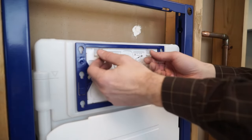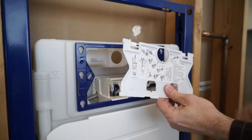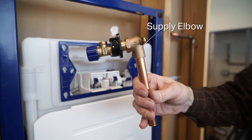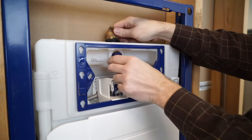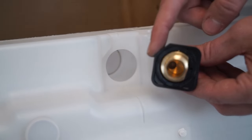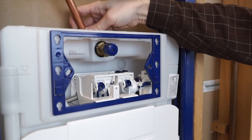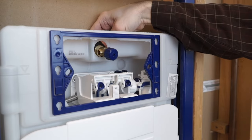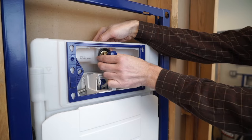To begin the water supply connection, remove the splash guard panel at the top of the tank by pushing down on the two tabs at the top of the panel. Carefully push out the round knockout centered at the top of the panel. Your water supply assembly should include the provided supply elbow and stop, plus a piece of supply piping cut to the right length. The supply stop features half-inch male NPT thread and can accept PEX, flexible PVC, and other supply piping. The connection can be made from the back of the tank or from the top by removing the cap. The Geberit supply stop features a cut corner on the flange that must match the indentations molded into the back and top of the tank. Install this assembly through the knockout in the tank and turn until the cut corner slides into the back indentation at the nine o'clock position.